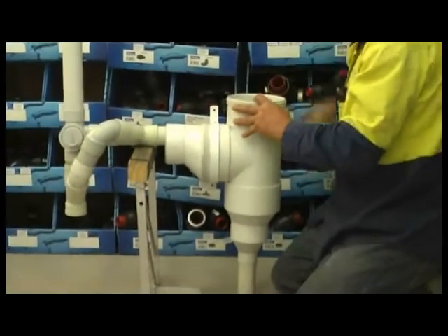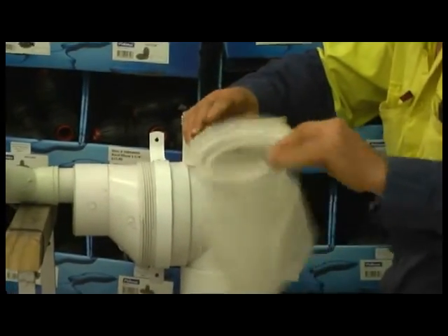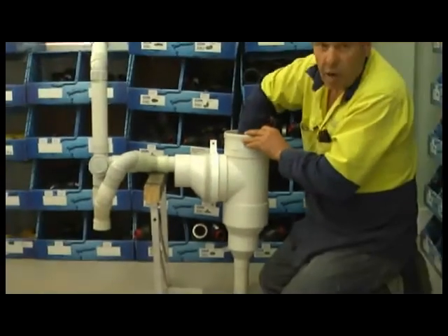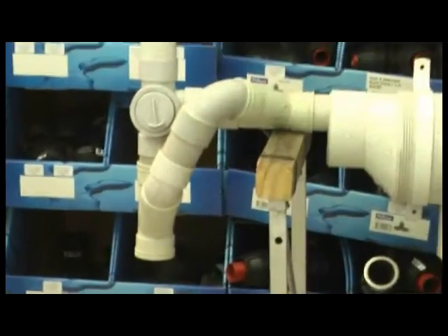Our filter body has a simple filter which will trap the hair and lint, and that's very important as it blocks up the irrigation. If the filter becomes blocked and you haven't done any maintenance, then it backflows and, as you can see here, goes off to the sewer or septic automatically.